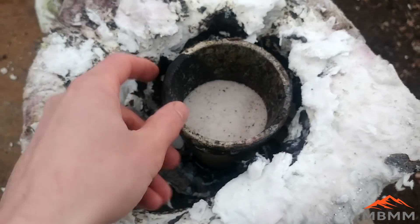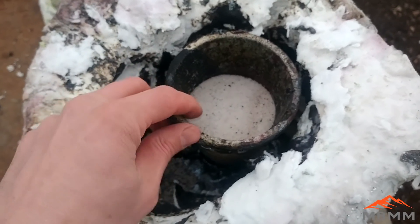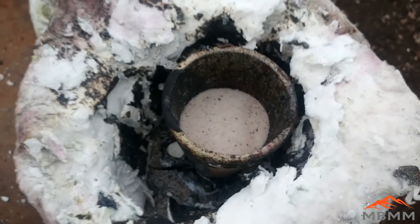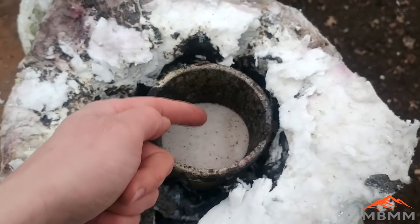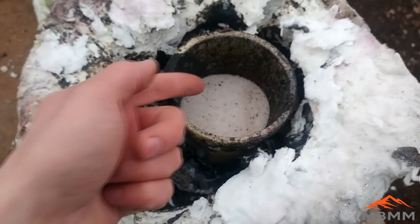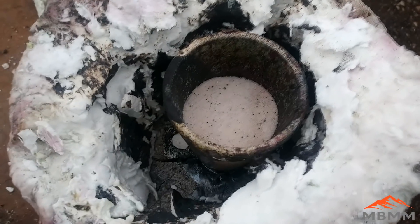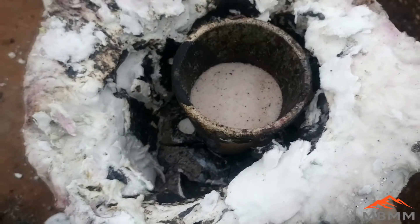Here's the first charge we're going to do — this is the borax and the sulfides. It's important when you're starting to smelt that you don't end up with your crucible more than about two-thirds or three-quarters full maximum, because as this heats up it's going to release a bunch of gas, and this whole charge is going to boil and foam and froth. You don't want it boiling over your crucible. Once it's all up to temperature it quiets way down, and it'll actually be about a third that much volume.